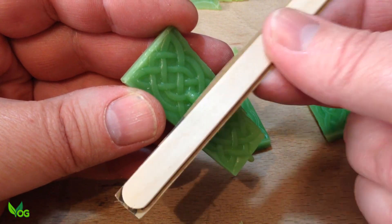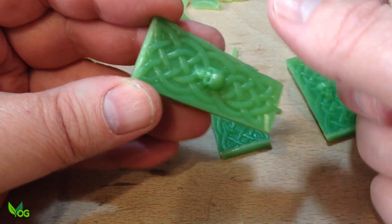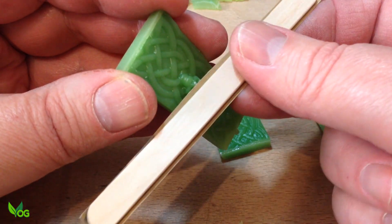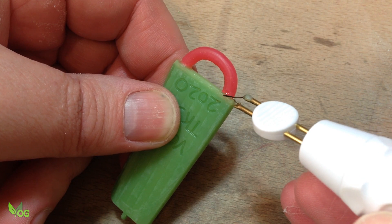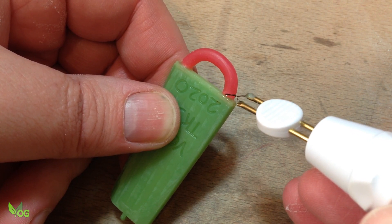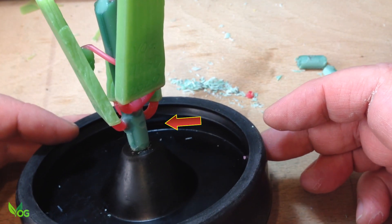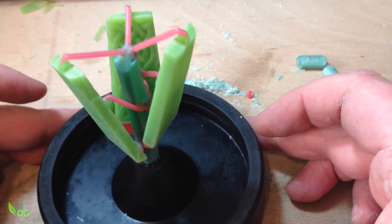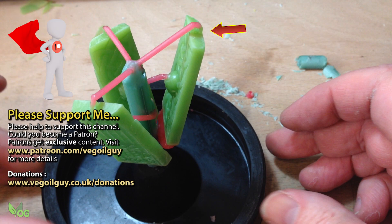Just a little clean up is needed with very fine grade paper. I possibly over sprue these, I'm not sure. The U-shaped double feed connects directly to the trunk of the casting tree. Hopefully from here you can see the other two connection points, both thin wax sprues — one to the pendant ring at the top and one to the crown of the skull.